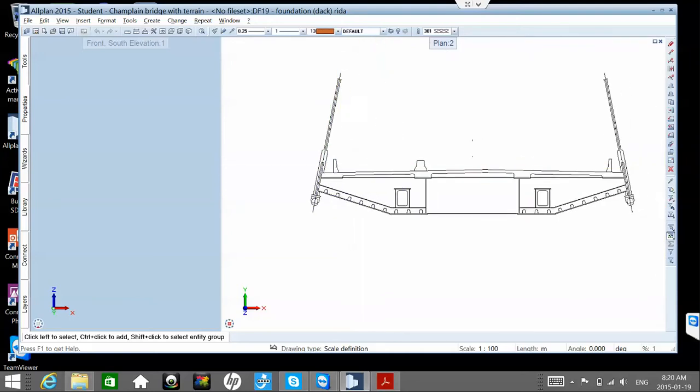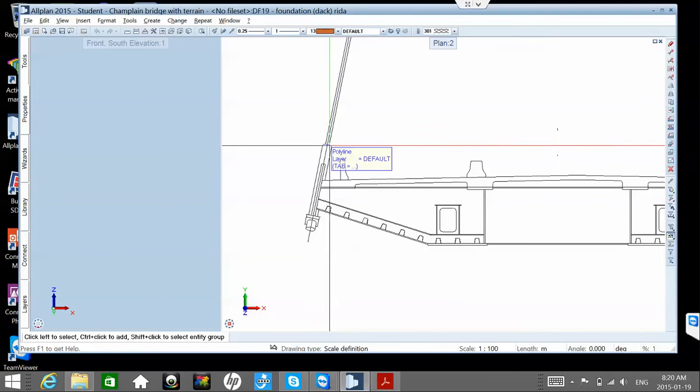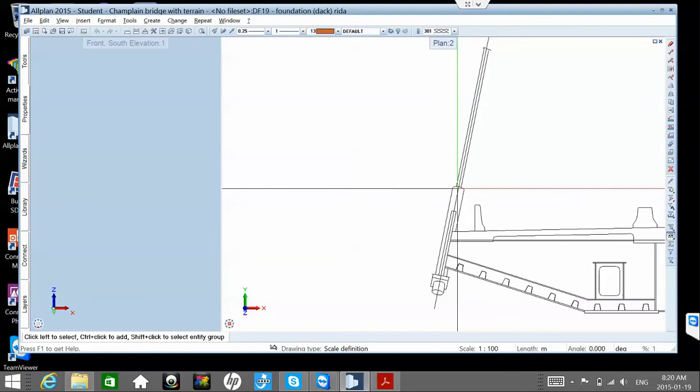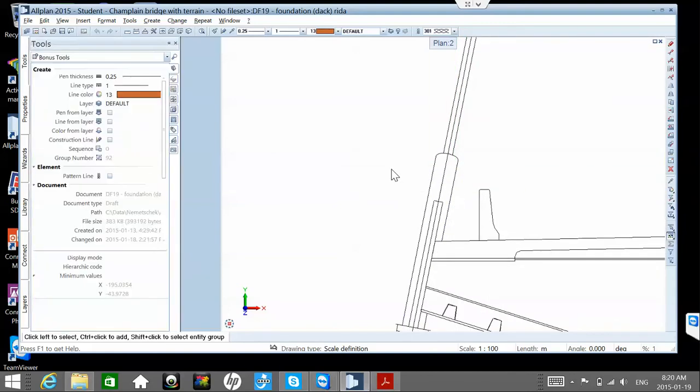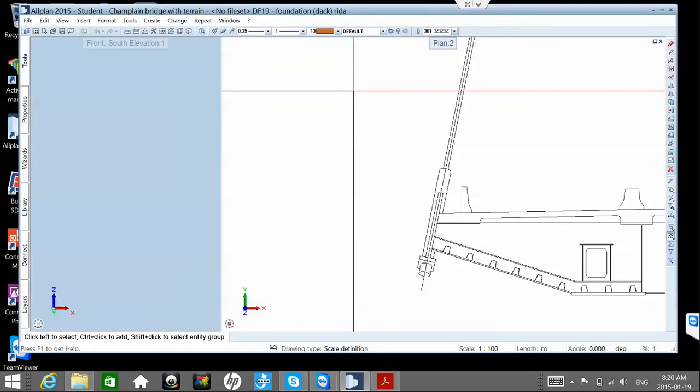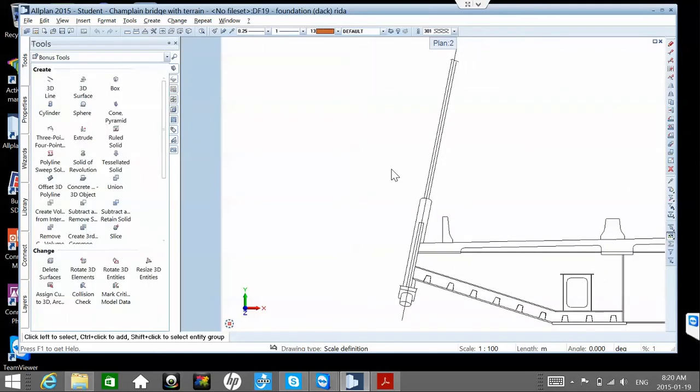Yes, try to measure some diameters here we'll need. I know it's okay, but I want some values. Because this is a projection, it's approximate somehow. So we need to know the diameter of the cable, the diameter of this ending, as we're going to design a cable with the endings and with editable span, let's say. And then we'll adapt this, we'll rotate it according to your 3D line and extend it till it touches the end. So we won't do the same operation, we'll only create a prototype of cable and we'll adapt it to every situation. So for this, we'll need some measurements.